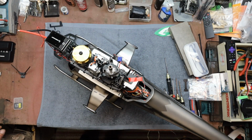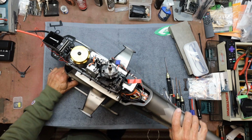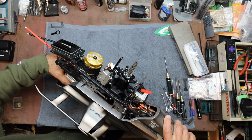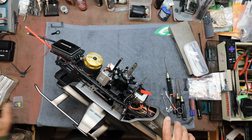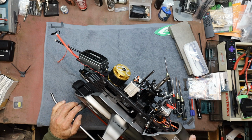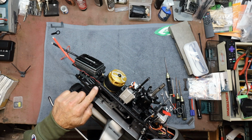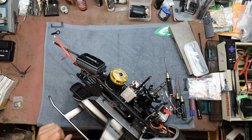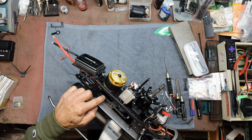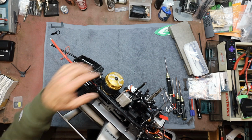Okay, so I've gone pretty far with this thing, and let me check in with what I've done so far. I've got the motor, I've got this in here just for some ballast, keep it from falling backwards. I got the motor mounted, which was easier than I thought it would be. There's so much adjustment on this plate that you just slide this plate all the way forward, and then the belt just basically falls right on. So that was actually easy. Fits in there very well.